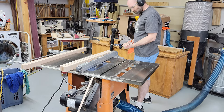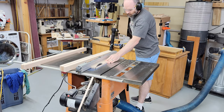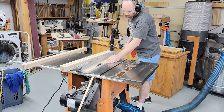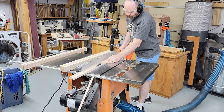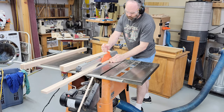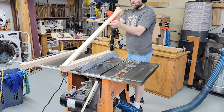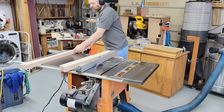To play it safe, I left enough wood to predictably account for any warping, so I ended up ripping maybe a 1/16 of an inch wider than the final width. This turned out to be a smart move because several of the boards warped again, just enough to need another light pass through the jointer. In hindsight, it probably would have been better to let the board sit for an hour or so after rough cutting, just to make sure all the internal tension worked its way out.